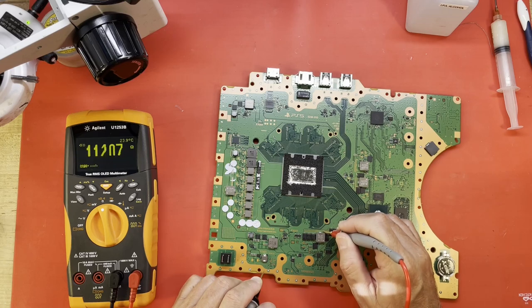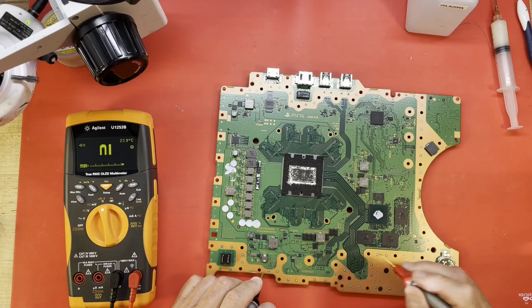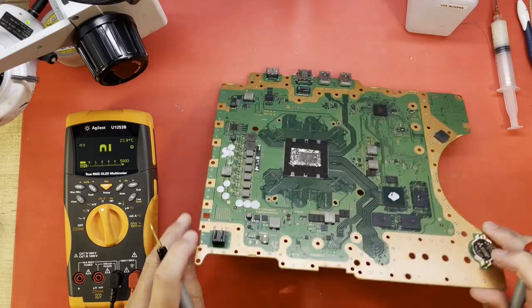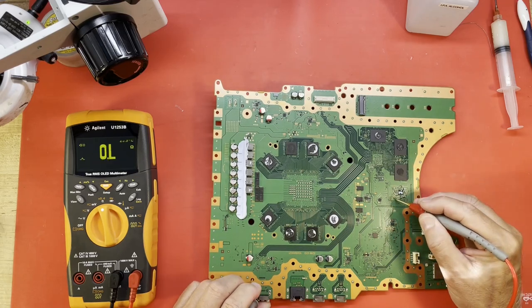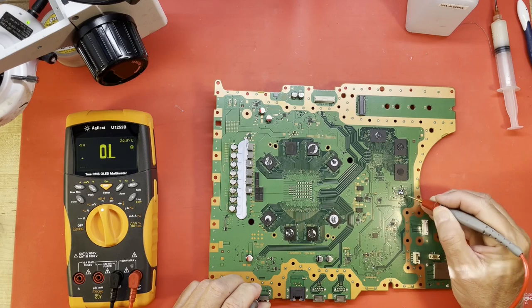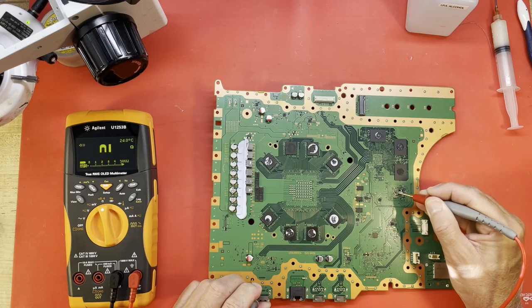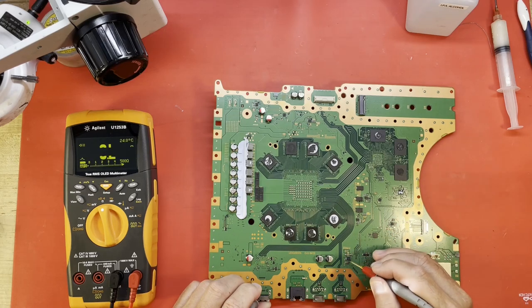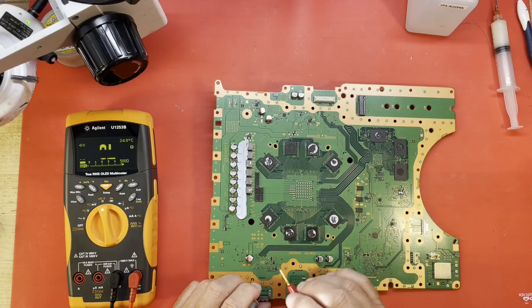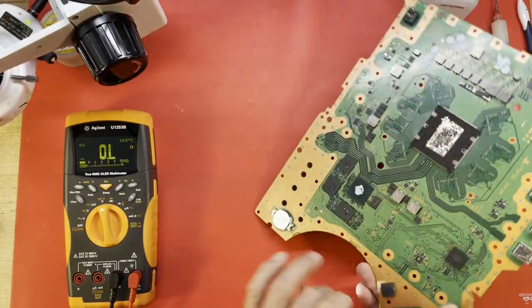Now this may be low resistance here. Not too bad. That's ground. Not going to be a quick and easy short, is it? How about around this SSD power supply? I'm hitting ground every now and then. That's why it's beeping. No. I'm hitting some capacitors around the HDMI circuit here. Should probably flip this over and look around the HDMI area some.